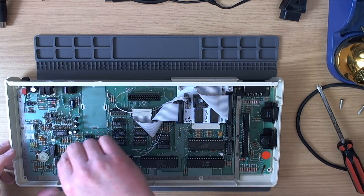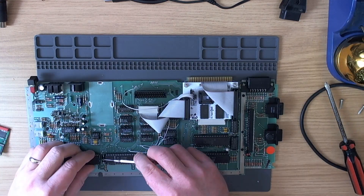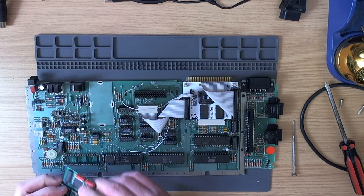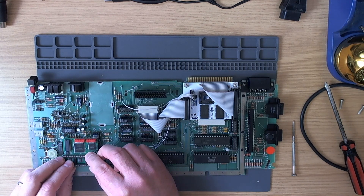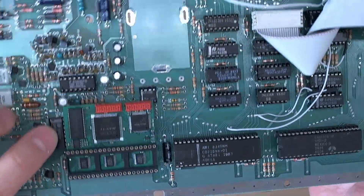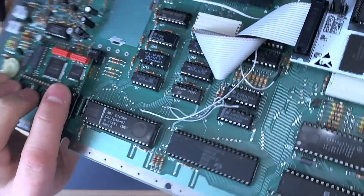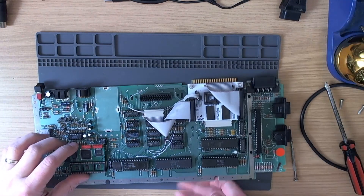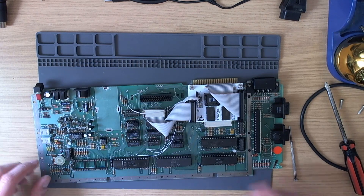Let's take this 600XL apart. The board isn't screwed in so it's just going to lift right out, and we'll do a test fit to see how it's going to go. We've already got a nice precision socket in here. It's going to clear the side of this chip here, but it isn't going to clear this one unfortunately - if we look sideways on, it's going to hit that. That's the audio chip, I think - so we're going to have to take that off.